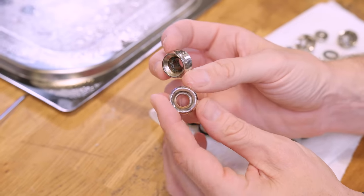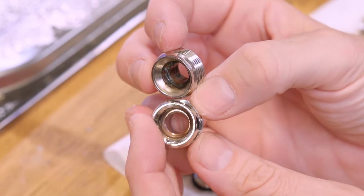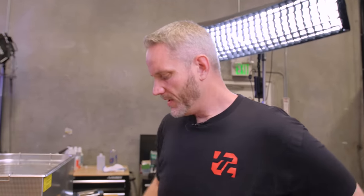This one here, once again, a lot of the nickel plating is gone. When you see flakes floating around in your loops, it could be some of these nickel platings coming off. They're going to react differently — every company's nickel plating procedure is a little different, maybe a slightly different chemical makeup. The fluids react differently, and the same fluid type can actually react differently with different colors.